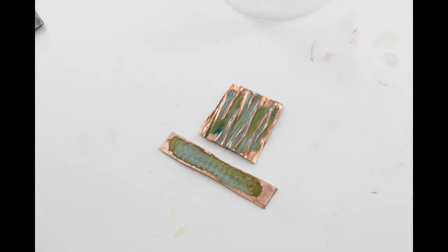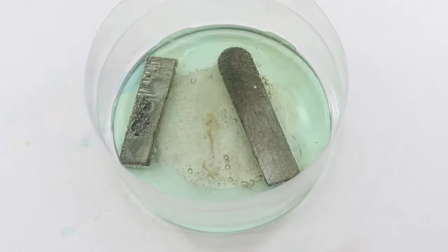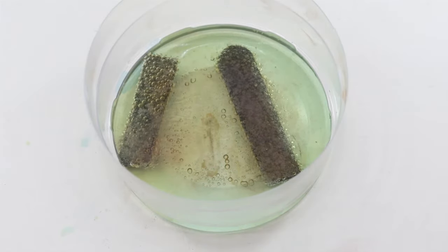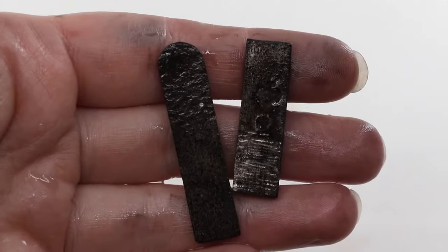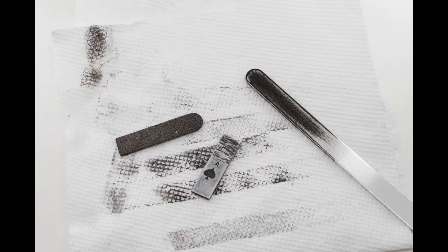Please excuse my dirty fingers — I've been touching the aluminum blackener finish. I recommend wearing gloves with these; they're not actually safe on skin. Speaking of the aluminum blackener, that's what we have next. It has a really interesting chemical reaction as it sits in the solution — it starts bubbling and fizzing. It gets really dark, but it almost seems corrosive and has a weird powdery black residue that comes off really easily. I don't recommend doing surfaces with this, but if you do any stamping of aluminum blanks, it's great for darkening inside stamps. The residue isn't fun, though.